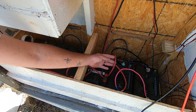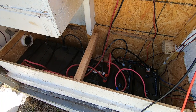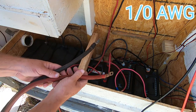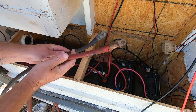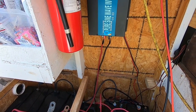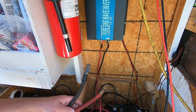Next up are battery terminals — our jumper wires from each battery. This was 6 gauge. We have some new wiring that we're going to be running today. Our new terminal for our batteries — this is a welding wire. The actual gauge is right here for you. This is going to be our new battery terminal. From each battery it's going to be going with this thicker wire. Our inverter was running 6 gauge — we're going to be running heavier duty wires off our inverter to our batteries.